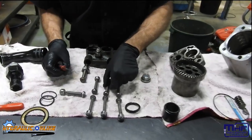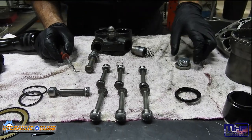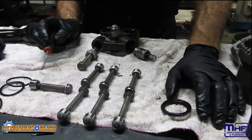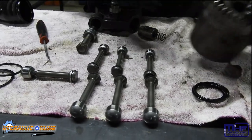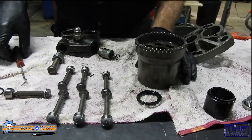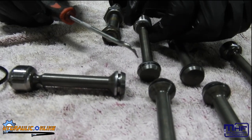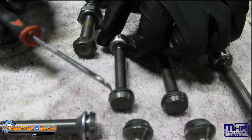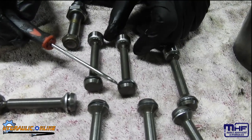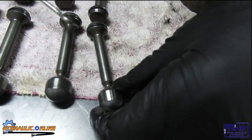These are the pistons removed from the bent axis piston pump. We had lots of shuttering going on, so we realized something wasn't going right. This is a set of seven pistons that fit into the barrel. As you can see, this one here doesn't have any piston rings at all, this one's piston rings are looking really sad, these ones not so good either, these ones look a bit abused.